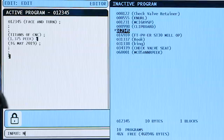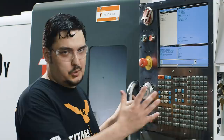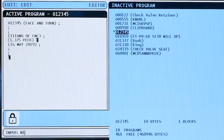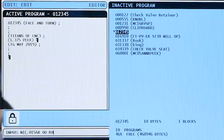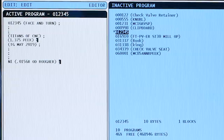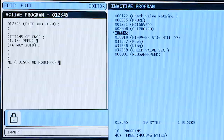The first thing I'm going to do is give it an N number with the number of my tool. All this N number is is a marker so that when I need to find a certain tool in the program I just search for it — N1 brings me to tool one, N2 brings me to tool two. So N1, and then in parentheses right after the N I'm going to give it my tool name: 0156 radius OD rougher. That just tells the operator what tool number this is and gives a tool label so you can easily find your first tool.